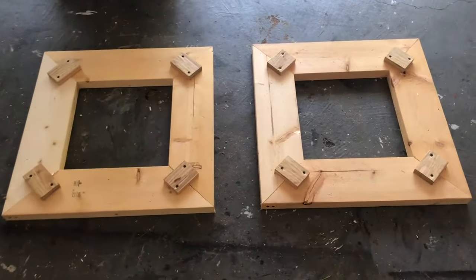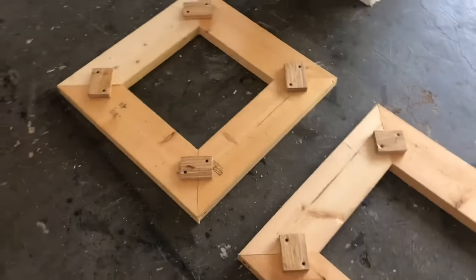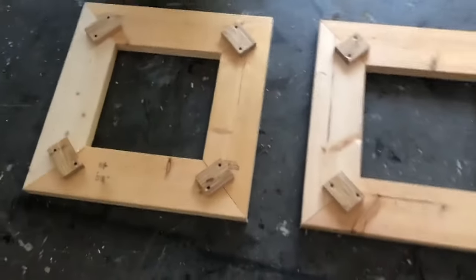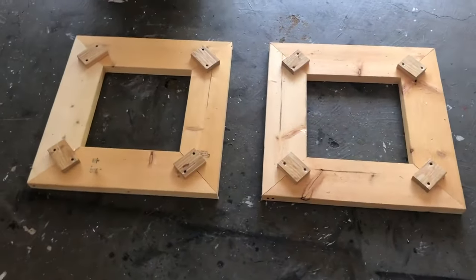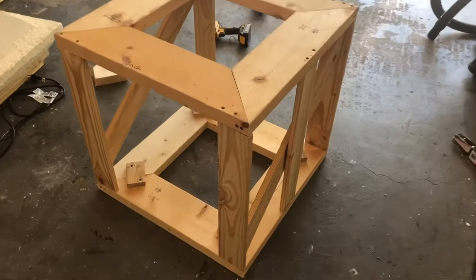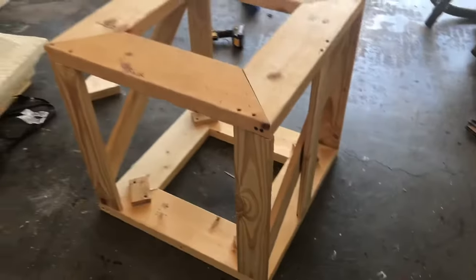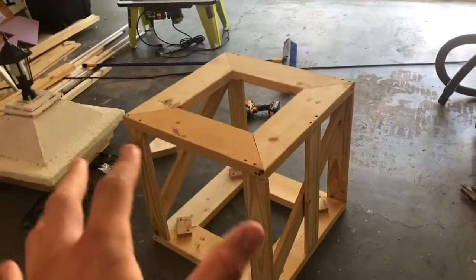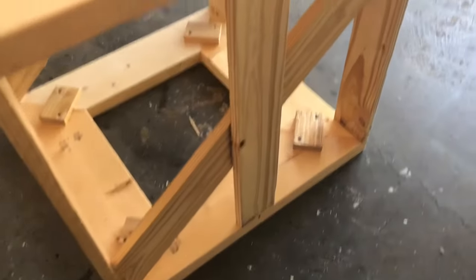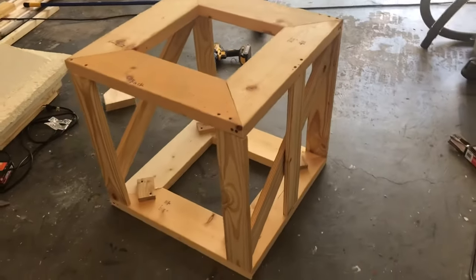So these are the two-foot by two-foot miter cut sections for the base of the column. They're made using two by sixes and are screwed in from both the sides and the top using a one by three acting as a bracket. Next I cut the one by fours for the sides. These are 21 inches in height, which makes it basically a two-foot cube. And I also cut the diagonal braces for the sides so that it doesn't move back and forth, which makes it a little more stable.